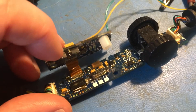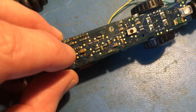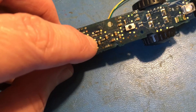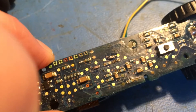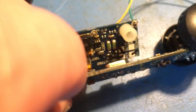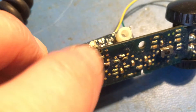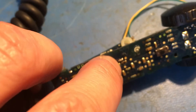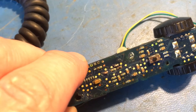The heat from soldering was obviously doing something, so I suspected the oscillator wasn't starting up - meaning either a fault with the crystal or with the loading capacitors, this one here and this one here. There's also a high-value resistor across the crystal, marked 106, which is quite common. I substituted a different crystal and that made no difference. I then used freezer spray to track it down, and it turned out that when I sprayed this capacitor here - where you can just see the fresh solder joints - it would stop working, but when I heated it with hot air it started working again.